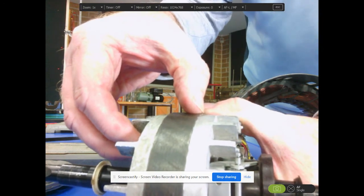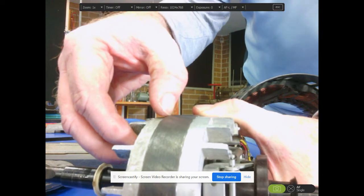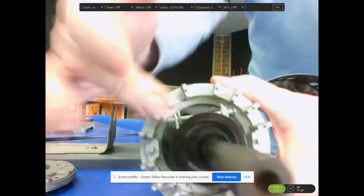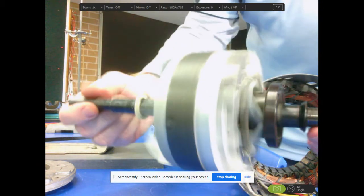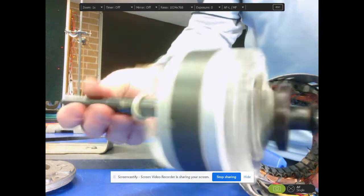We know why that happens, don't we? That's lamination. And this is to reduce eddy currents in a few more moments. That's to reduce heating, of course. We want eddy currents because it's the reason why it is moving. And it's attached to an axis, which enables this to spin on itself like that. Okay, so that's the rotor. That's the one that we want to rotate.